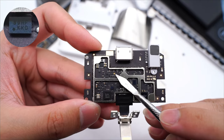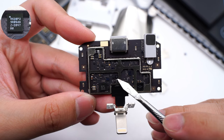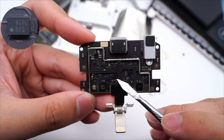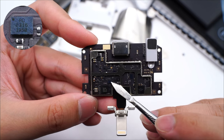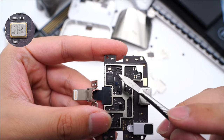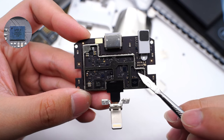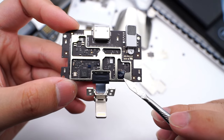This is a KKD chip marked with S9AF. The VBUS MOSFET is from NXP, used to control the charging. A chip marked with 9C9L025, and a chip marked with AD03161950. This is an NXP chip marked with SD9452C. The passive crystal oscillator is marked with T120. An Apple chip marked with 338S1081, and here is the Apple audio conversion chip marked with 338S1146.